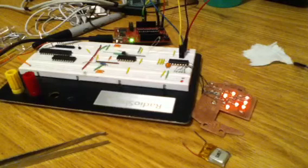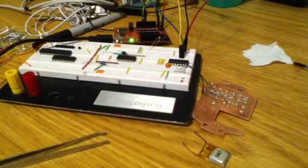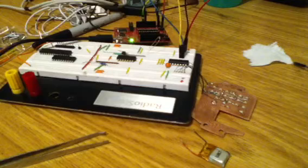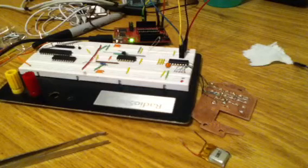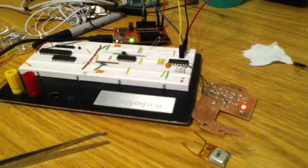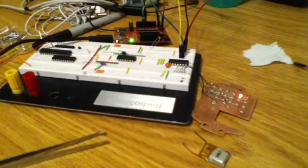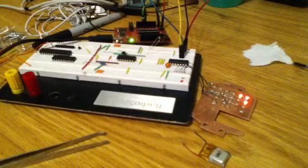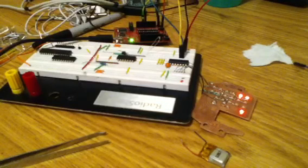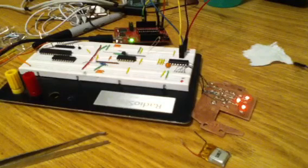And if you watch the LEDs, you'll see that they will turn off when the MSP is being flashed, right here. And then the debug cycle ends on my computer, and now I will press the run button, and there will be a short delay for initialization, and then the LEDs will turn on and begin counting up from 0. So there you can see it's now at 6, 7, 8, 9, 10, and as you can see it shifted over to the next column as it moved into the tens place. And then here it'll do it again, 8, 9, 10, and now it's at 20, so the next column shifted up to 2, which would be the second light.